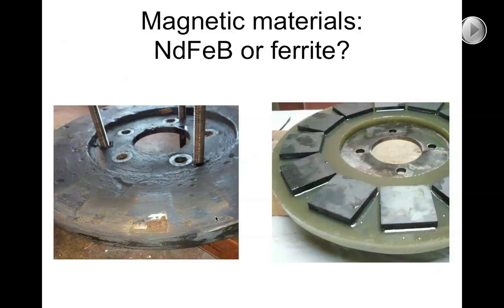But this also made me look back at ferrite technology. Ferrite magnets are a lot cheaper if you can buy them in sufficient numbers to overcome the markup and transport costs. They're so cheap in quantity that, as you can see on the right, you can cover your magnet rotor with magnet material and to an extent compensate for the lower flux density you get with ferrite magnets.